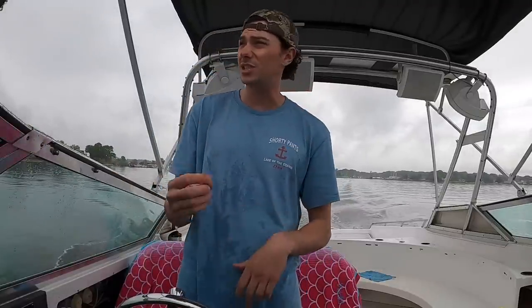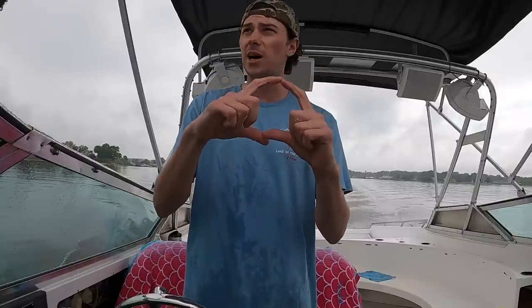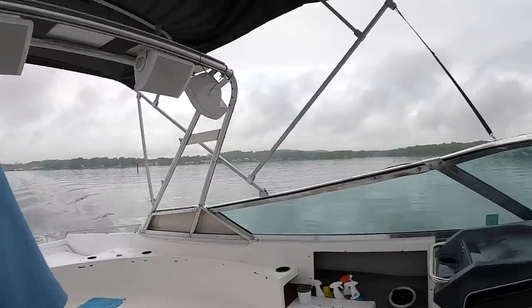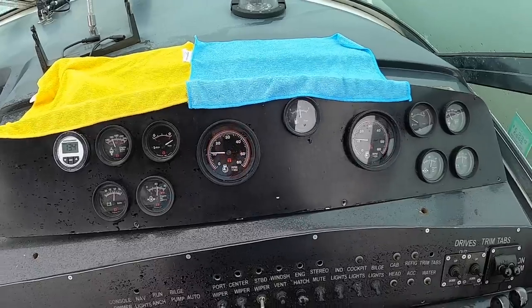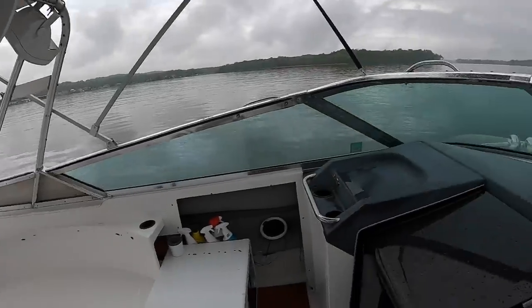And I did that little cutout on the throttles. The engines used to hiss really bad with air when it was coming back from getting past that throttle body intake. It would hit that dam and just make this big hissing noise. Now the engines are a lot more throaty, much quieter actually underway. All right, we are past the 6 mile an hour mark, about 1,000 RPM. We can go ahead and get up on plane.